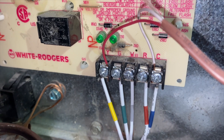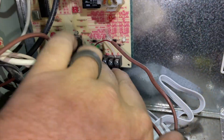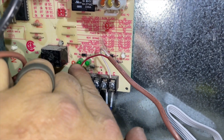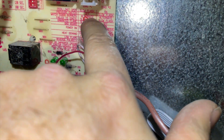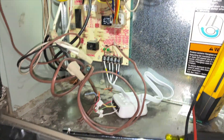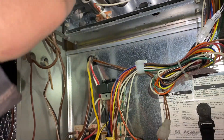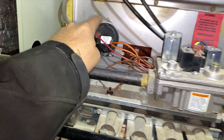It's hard to see because I've got all kinds of lights and it's dark in here. This light here and this one are flashing, and then this one's off. According to the code it's a pressure switch - it's not closing. So we're going to reset the unit - it is calling for heat - and then we're going to see if the inducer is working. I spun it and it feels okay, so apparently this has been changed before.